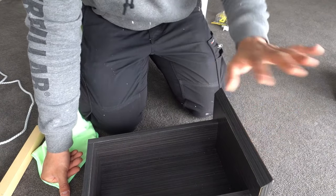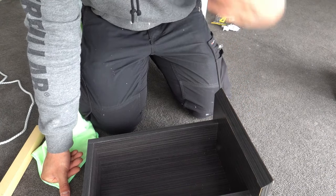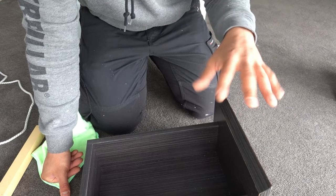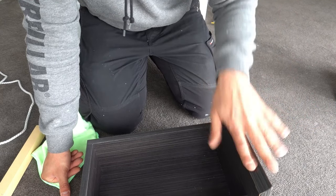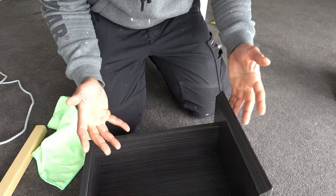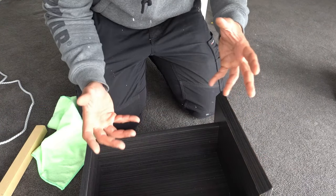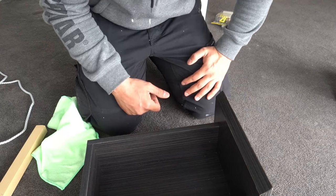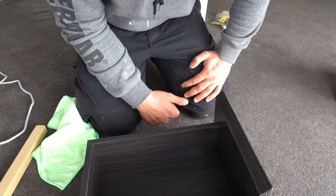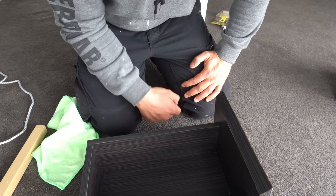That's a nice easy way to get your laminated edging on — any kind of edging, even for your cupboard doors, pantry doors, or kitchen bench tops. All the exact same process. If it's starting to come away, simply apply a little bit of heat using the iron — that's going to soften the adhesive and allow it all to stick back on. Hopefully this video has helped you guys out. As always, like, comment and subscribe. Until next time, I'm Bill — thanks for watching.